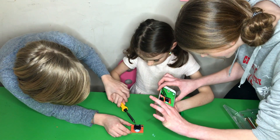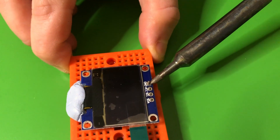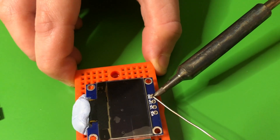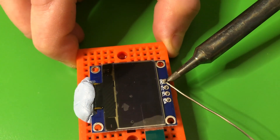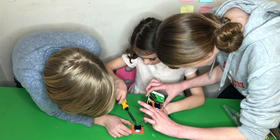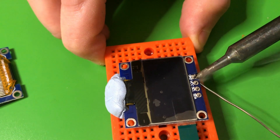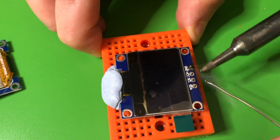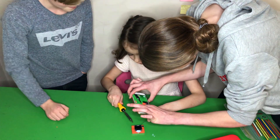Maybe move your hand upwards so you're kind of pushing down and forwards. Then just touch the solder — you can see it's melting a little bit. Be a bit closer to the soldering iron and put the solder a little bit closer so it's easier for it to melt. A little bit more solder — that's enough. Slide it off. Well done! Your first pin. That is pretty good.